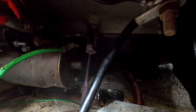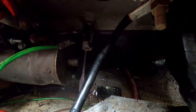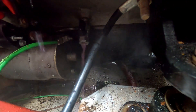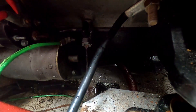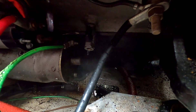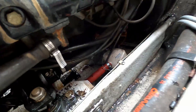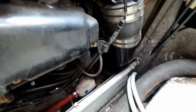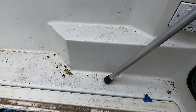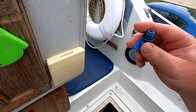Still coming out. Pretty much ended there — little drips coming, everything else is good. We're still steaming, see here this is holding heat. Water's still dripping, we're still steaming. But with all the antifreeze we pumped through, we should not have to worry about this being able to freeze on us. I actually put seven gallons through this — I had five in it beforehand and then added two more.